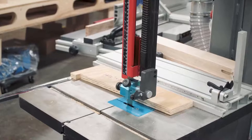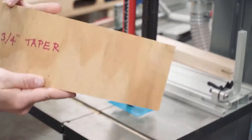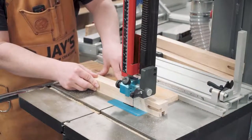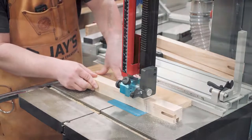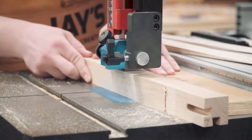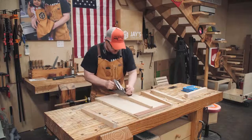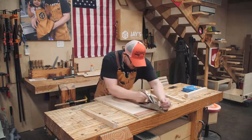One of the simplest ways to make a leg more interesting is by adding a taper. There are many ways to cut a taper, but I already had a specific taper block for the bandsaw that matched the dimensions I needed, so that's the route I took. Just like the previous bandsaw cuts, the tapers were cut with a smidgen more material left on than the final desired amount. You can get a good look at the taper as well as the nearly perfect grain appearance on the legs. Back at the workbench the tapers were quickly cleaned up with a couple passes of a smoothing plane.